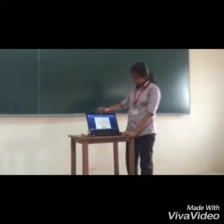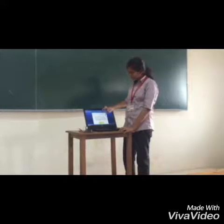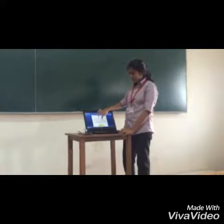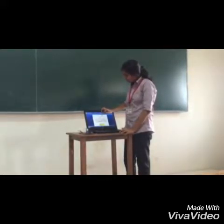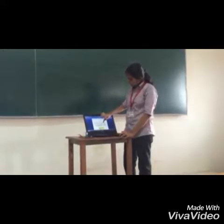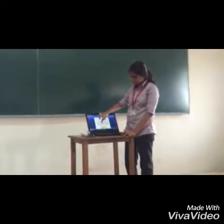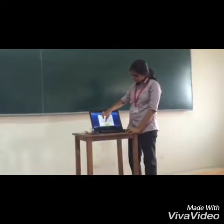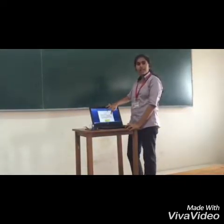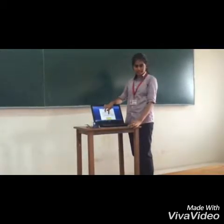In our circuit, this is the wire loop where the luggage is connected, and this is where the alarm is placed. When the voltage is applied and the wire loop is intact, all four NAND gates are short-circuited. The voltage input 0, 0 comes to the first NAND gate, and the output 0 cascades through the subsequent NAND gates, resulting in an output of 0. The diode does not conduct because the output of the NAND gate is 0.